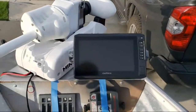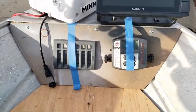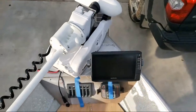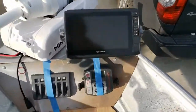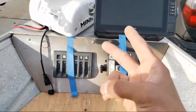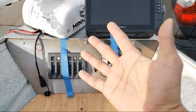There's a little mock-up made out of particle board — we made a template to close off the bow compartment. That will be sheet aluminum, similar to what the trolling motor and graph are mounted on, supported by some angle brackets behind it so it'll be super solid and closed off. We've also got a six-panel switch here that controls navigation lights, bilge pump, and pump in and out for the live well.